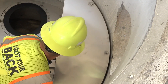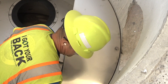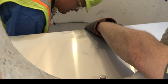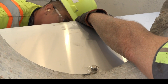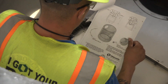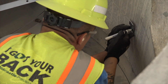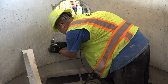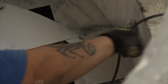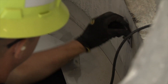Next, position the upper support ring centered on the center seam of the partition plate assembly, not the inlet hole opening. Using a marking pen, draw a line on the concrete along the bottom edge of the upper support ring. Position Z clips so that the lip of the clip lines up with the marked line. Mark and drill the top hole of the clip, hammer in the wedge anchors. Turn the clip so the receiving side is up, and screw them in.